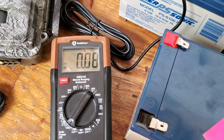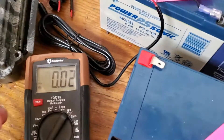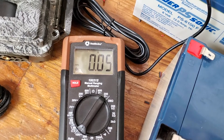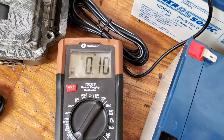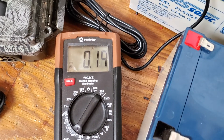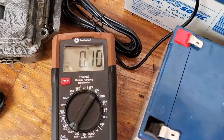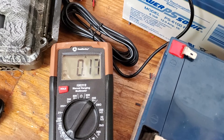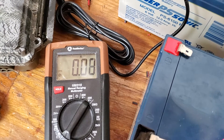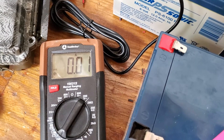What I saw here at my house in my shop is about 30 to 35 seconds from the time we start seeing the draw go up to when my phone app receives the picture. It's back down to neutral — it took another picture and is now connecting to the network. You'll see it go up to a higher number — that's the final transmission where the radio inside the camera is using the most power. The highest we saw there was 1.19 amps.